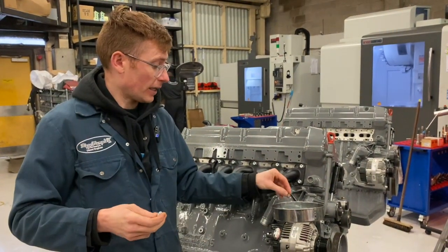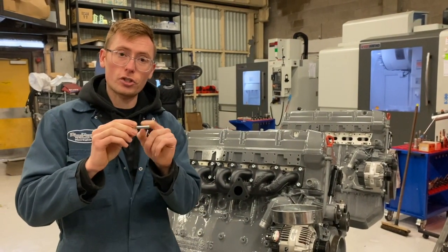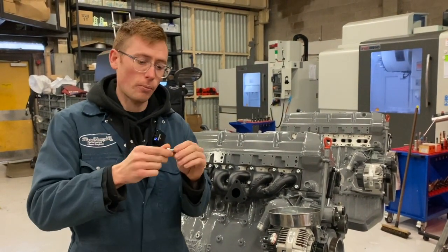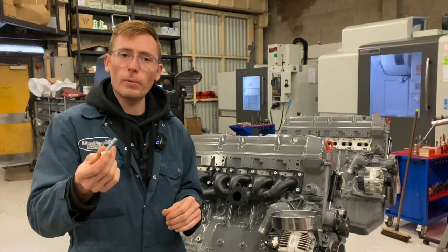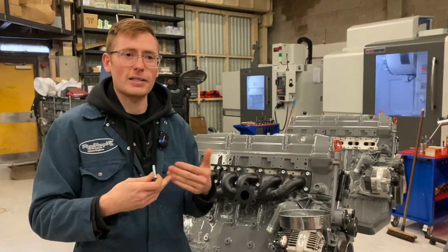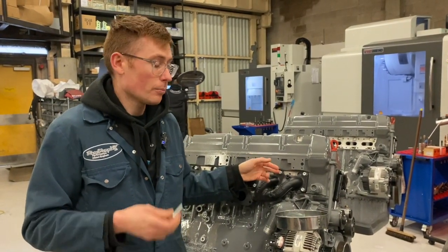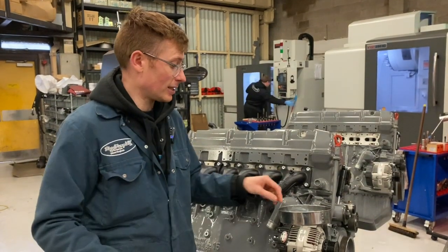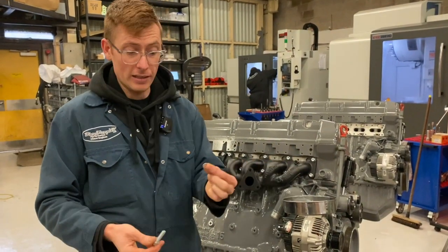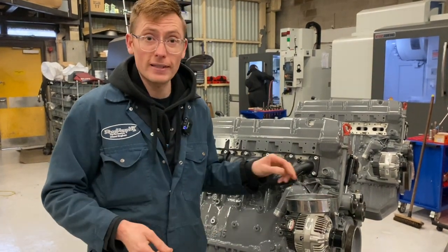The best thing is you can even use some copper slip just to stop these threads galling and to stop them seizing over time — which normally you'd be quite wary of using any kind of anti-seize compound when you already have a problem with bolts coming loose. But with this solution it's the best of both worlds: use your anti-seize compound, put that in, and it all works quite nicely together. It's a really fantastic system.